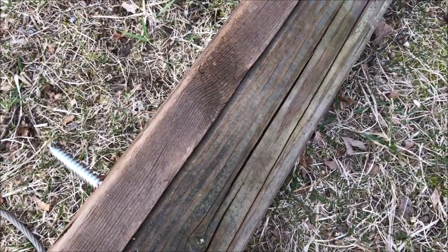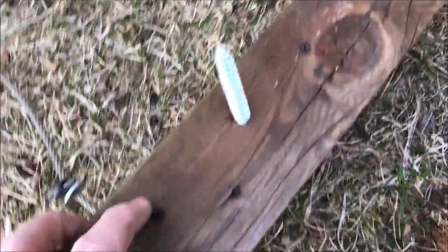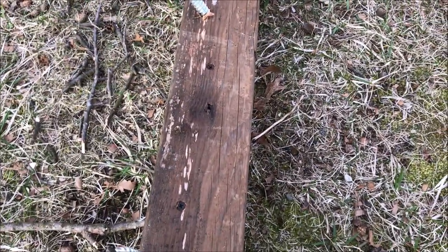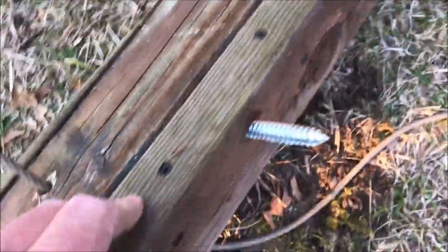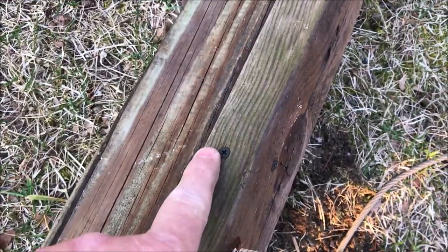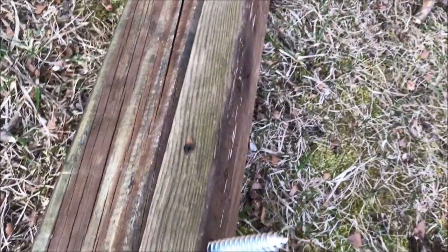I have all the pressure from the 4x4 being mated to the 2x4 with wood screws. If the screws fail I'll put quarter-inch carriage bolts in instead, but for now I'll try the screws. On the back side I also put one screw on each side of the lag bolt to discourage the wood from cracking out.